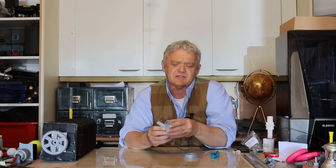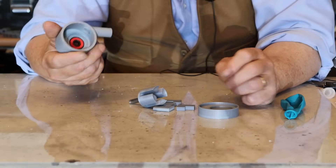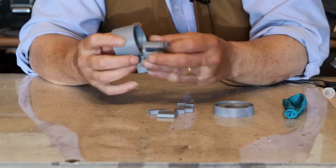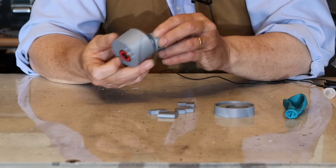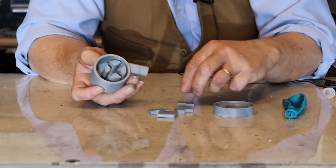But let's have a look at how it's actually made. There are in fact only four sections: there's a central rotor section, there's this body housing and a cap, and then there are four little slotted things called vanes. The rotor goes in that there — that is a skater bearing, 22mm by 8mm by 7mm. The rotor goes through there and I've put a bit of 8mm steel bar on the rotor.